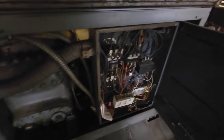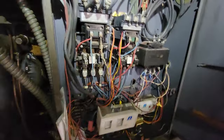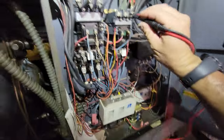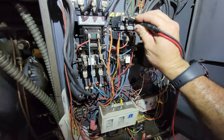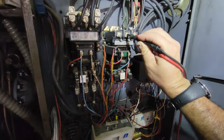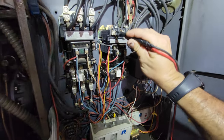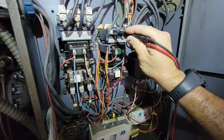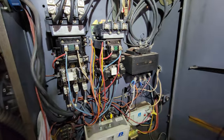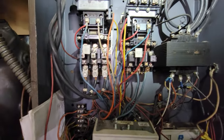Let's see if we got equal amperage in this motor, if it'll reset. We got a little bit better light now. We're going to go ahead and check our voltage — we've been having issues, it sounds like, in this town. That's 466, 468, 465. Sounds about right. Don't know what it is down below here. As far as the protector, we got an Allen Bradley here.